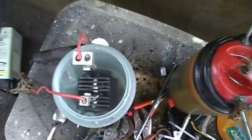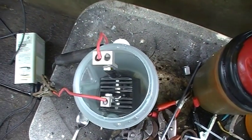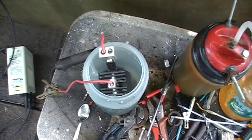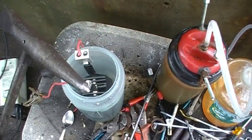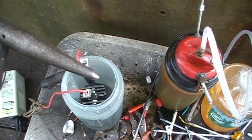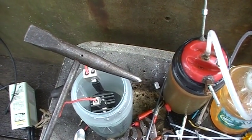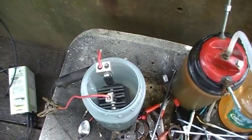If you're making a SMACK booster, the most difficult part is doing the center punch thing. So I said I've got to have an easier way to do this, because I'm not doing this to 14, 16 plates, whatever it is. Instead of using the spring-loaded center punch, which takes 10 hours to do one plate the right way, go to Harbor Freight and get yourself a welding slag hammer. Turn it down so it's not like a needle, but sharp and wide. This will make your job a thousand times easier. I can do 500 dents in the time it takes somebody to do 20 holes with an automatic center punch. It's really fast, really easy — bang bang bang bang. You can get it done quicker. It'll save you a lot of time.